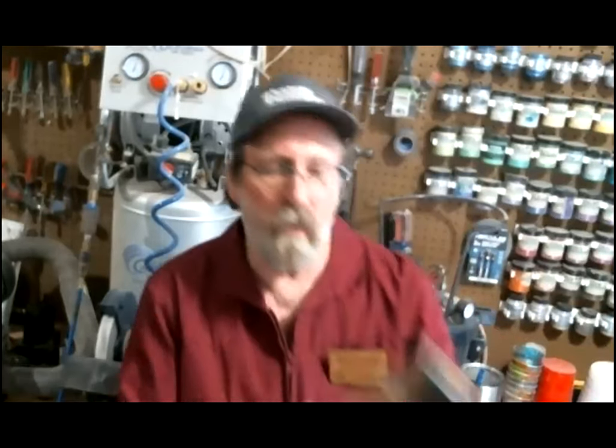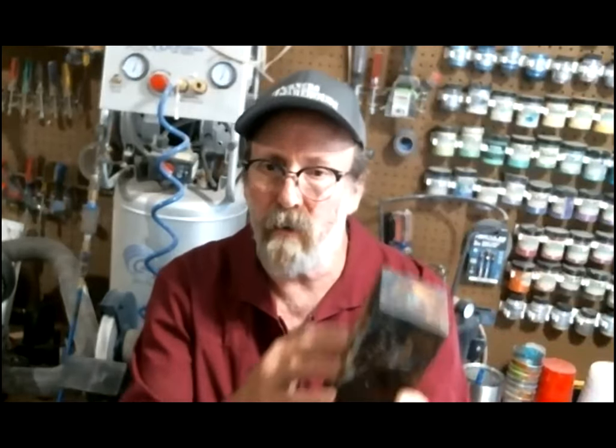My advice to you all as woodturners is, if you're trying to do a cast where you're building up on a piece of burl, or you're building up something and you're adding on to a piece of wood, then this is the resin for you. If you're trying to fill a small void, say you turn a bowl and it's got a nice little natural crack in it, and you want to fill that, then this is not the right resin for you.